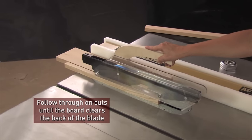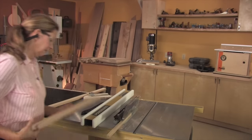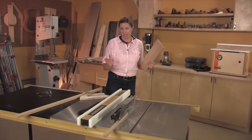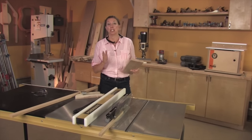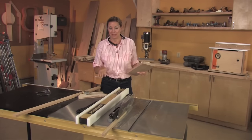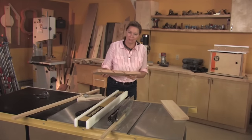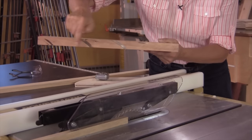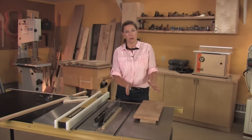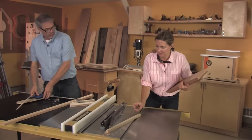The waste side is called the falling stock, leaving you with what's called the work piece. You need to get the right feed rate for your saw, because if you cut too fast it can degrade the quality of the cut and lead to a binding situation, which can mean kickback. By the same token, you don't want to cut too slow — the blade can actually burn the wood, and cherry is notorious for that. So Goldilocks it: find just the right feed rate.